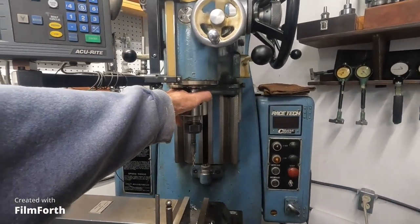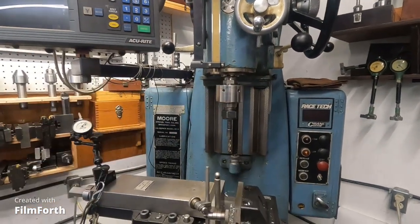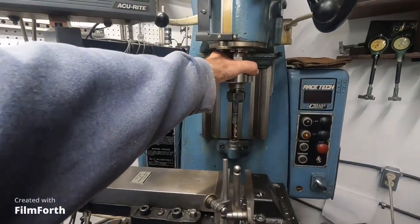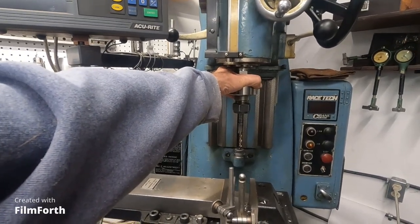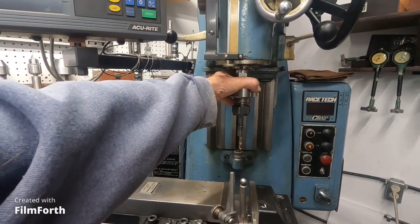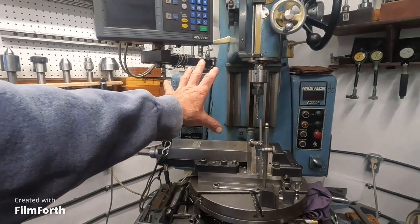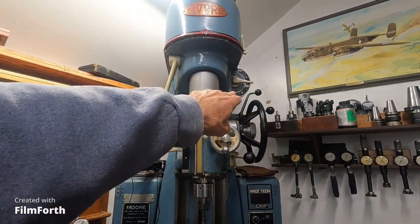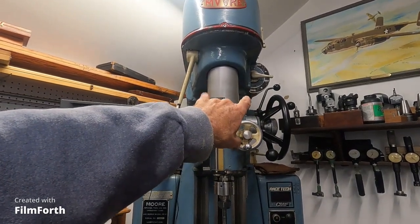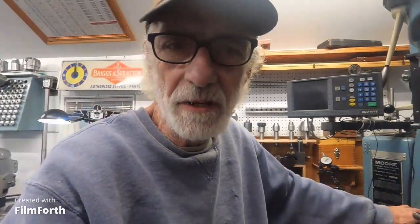I reworked the drive up here to reduce the feed. If you look up here, it'll say 0.0008 — eight ten-thousandths. This jig borer is a custom machine, a single speed with higher horsepower that was delivered out at Hanford. It has about a 2,850 spindle speed on it. I asked Moore about it a long time ago and they said it was adjusted like that — don't mess with it. So when I reduced the feed, this slipped into that parameter. The number three Moore jig borer that they came out with has less than one thousandth on its finest feed, so that fits into the parameter for plus or minus one ten-thousandth.